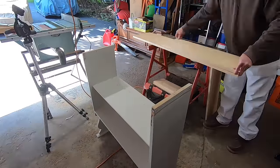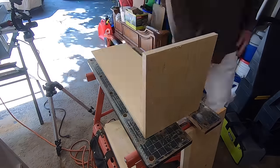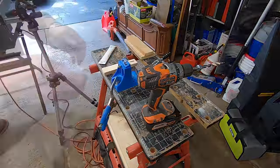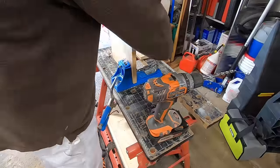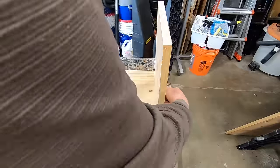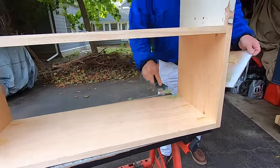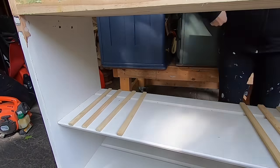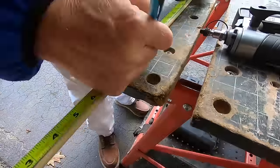You saved the existing, the original molding. I used the Kreg jig because I don't have a good dado blade. My table saw doesn't allow more than like two blades for a dado, and it's not thick enough to make the cuts that I wanted. So I just used the Kreg jig — it's the easiest way to do it, even though it's kind of a generic way of woodworking. It's an easy way to put things together without having any skill. So we're taking a plate and sorting out the best way to make the plate racks, and we devised a system.